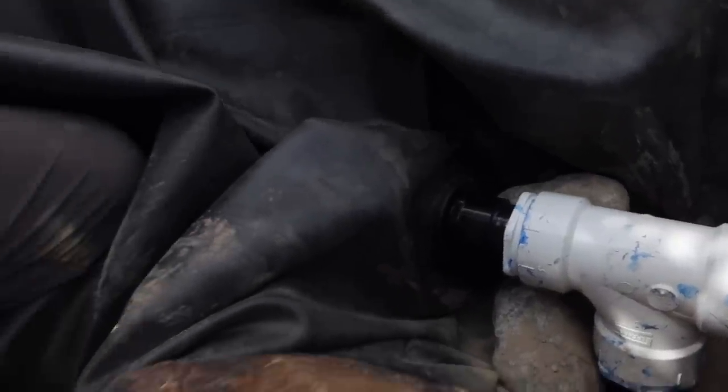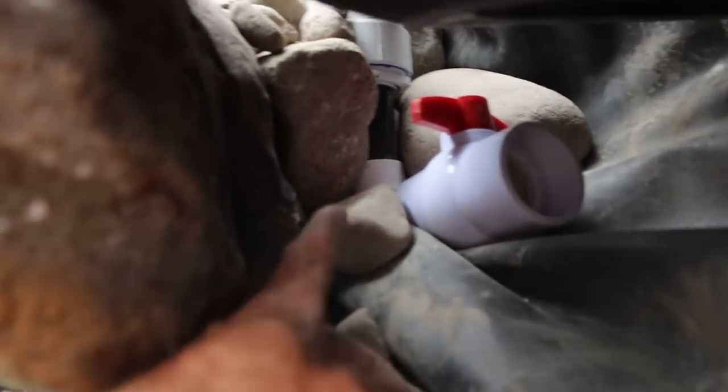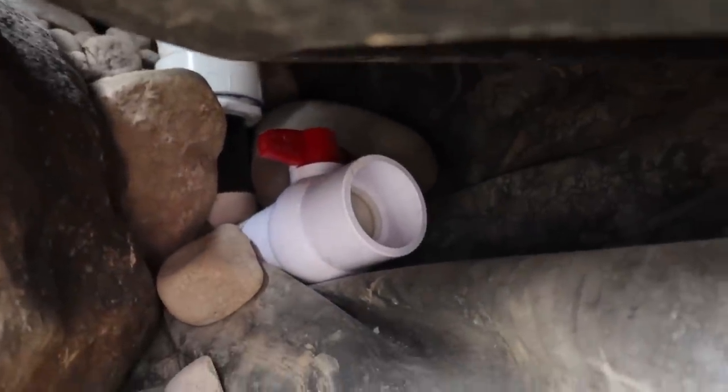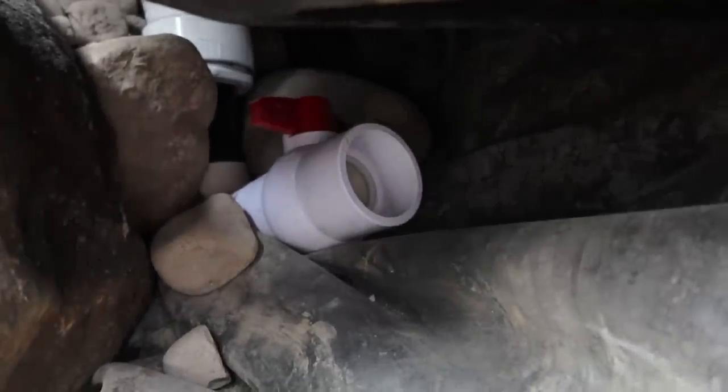We put a bunch of cobbles around just to stabilize this pipe, then we'll come back on the backside of the liner and attach our plumbing. We don't want all that rock and gravel to slide down and obstruct that ball valve down there. One has done a really good job locking those cobbles into place so we can still get our arm back in there. It's the easiest way to hide the fittings — everything inside the liner — as opposed to digging in a valve box outside the liner after the fact. As you can see by the wheelbarrow, we were starting to get rain. Very unfortunate, because we were just hitting our stride with all the plumbing done and starting the detail work inside the waterfalls.